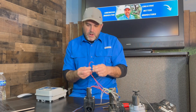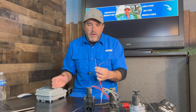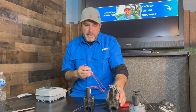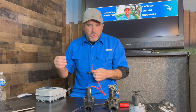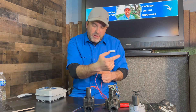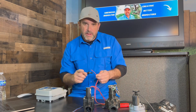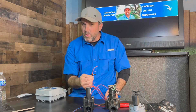You've got two wires. There's going to be one wire from the controller that's a power wire — the main source of sending power to each valve. Each valve is going to be separately wired into a different power wire, but you're also going to have what's called a common wire. This common is going to run to every single valve. You only need one common wire going to every valve, but every valve has got to have one power wire.